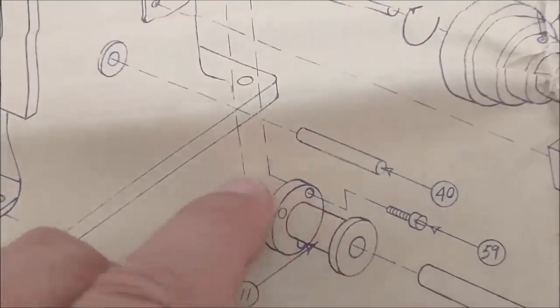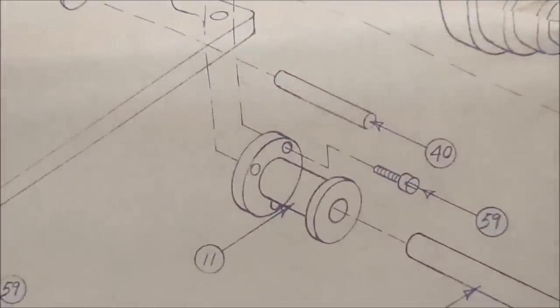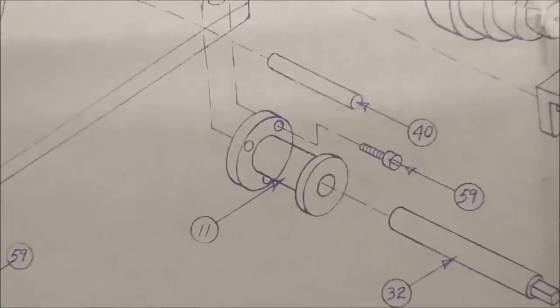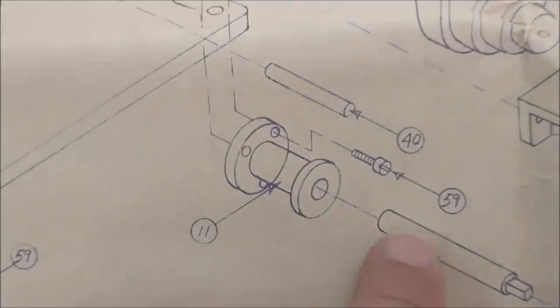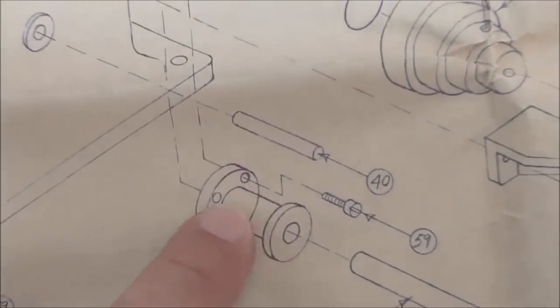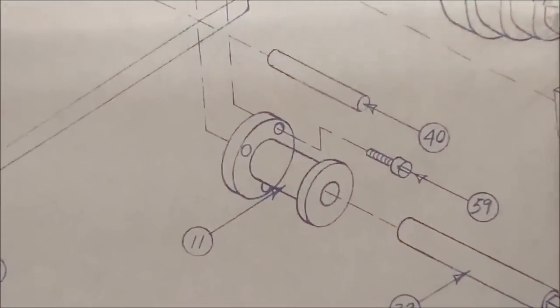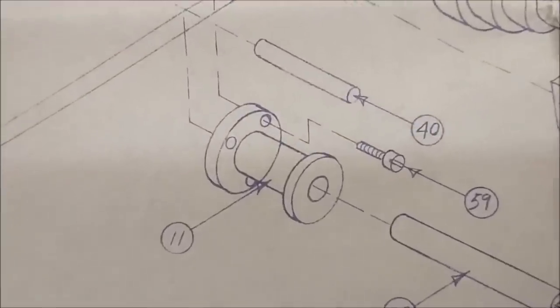I'm going to do that so that I can drill these out before I part it off. That's the only reason. It's a 5/8 diameter stock, .625. I'm going to put it in the collet and have at it. You can technically do all of this with one tool, with the exception of the through bore, of course. You could face it, plunge the OD, plunge the undercut, plunge the other OD, and then take it to the mill. I'll probably do it with two tools just for the sake of not confusing things. All right, let's do it.